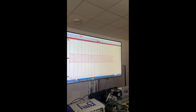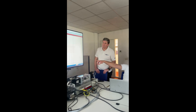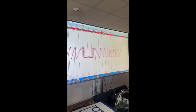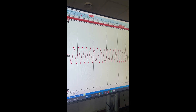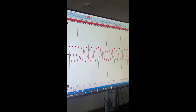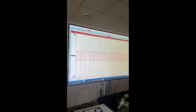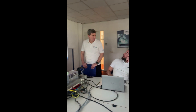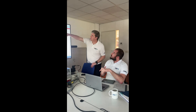The cycle detect is a pretty unique thing. We track the fundamental frequency, which is the rotational speed. If we speed this up or slow it down, that black square wave is the time period we use for averaging power. I thought we average it every half cycle — yeah, we average the sum of all the points every half cycle. You take the mean to get power, you take the RMS to get RMS.